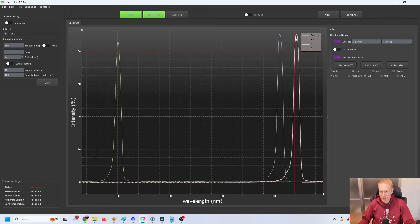For sulfur 2, we're targeting 672 nanometers and the peak is right at 672 nanometers — very well centered. Transmission is above 90%, which was also the case for H-alpha. But again, the bandpass measures closer to 6.5 nanometers rather than 5 nanometers. Keep in mind: for this particular sample I did not measure 5 nanometer bandpasses but around 6 to 6.5 nanometers — less good than expected, still crazy good for the price, but not up to spec.